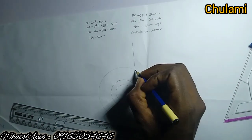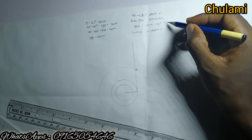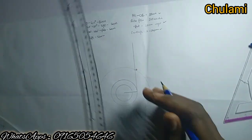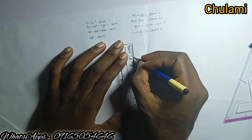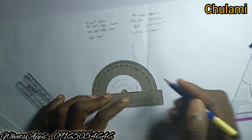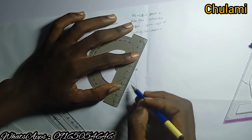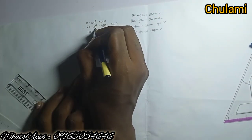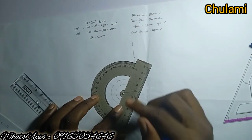At this point is where the lift starts. Lift is 36 millimeters. From this point, measure 36 millimeters (3.6 cm), then divide by 2 to get 18 — that's the half for SHM. Now mark the angular motions: dwell is 60 degrees. Count 60 degrees and draw that line on the offset circle only. Then for the lift from 60 to 180 degrees, that's 120 degrees, and the fall is 180 degrees.